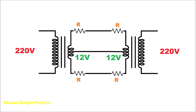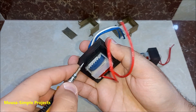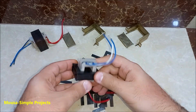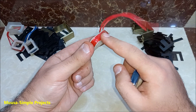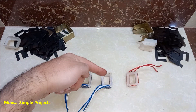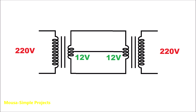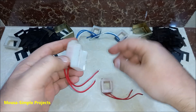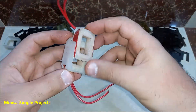That's because of the internal resistance of the transformer winding. So I decided to modify these transformers. I start to remove the lamination of the core and tear it down. The red winding is the high voltage and the blue one is the low voltage. So instead of using four windings with two transformers, we can use two windings with a single transformer. By this method, we can increase the efficiency and reduce the voltage drop.